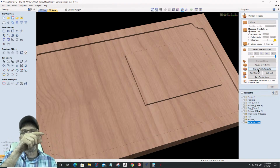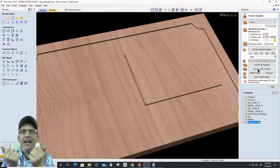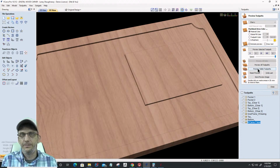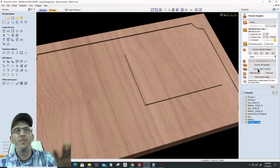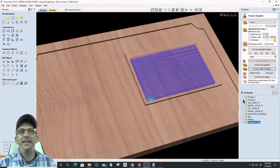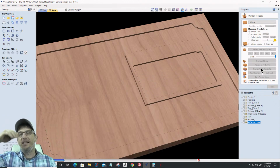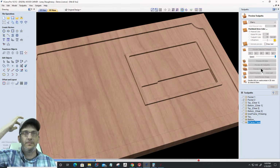But we have an extra frame border there on the inside, that little frame, and it needs to be offset outward just like the top text. So this is my clearing pocket. It clears away that 1/8 of an inch, followed by my inner pocket, which clears away the inside of my frame down to the 3/8 of an inch cut depth that I wanted. Okay?